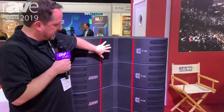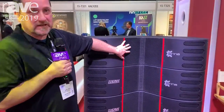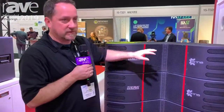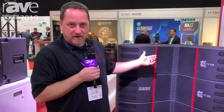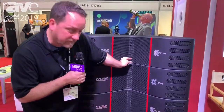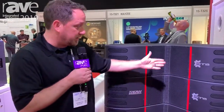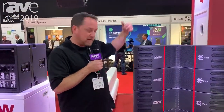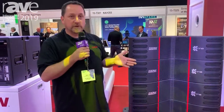What we've done inside here is each of these boxes has 14 amplifiers and drivers that are each individually controlled, each with its own custom FIR filter, to basically say I can take each one of those at a resolution of one inch to be able to steer sound straight up or straight down based on the geometry I give it for the room. So we will draw it in 3D, place this at the height it needs to be at, and then we're going to have the software calculate the virtual J that it takes to pull off the same thing a real J would do.